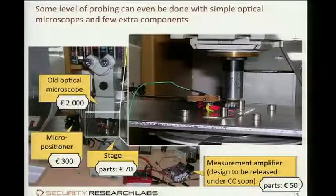Yeah. When you get the needle in position, some folks prefer TTL buffers as buffer circuit. I prefer an operational amplifier in voltage follower mode because it's more transparent electrically. And to know if I'm in the right position, it's just easy. I look at the noise level of the needle, and when the needle is coming in contact with the chip surface and on any wire, hopefully at the right one, the noise level is dropping because the chip is grounded through the EEPROM programmer circuit. That is how I can know for sure that I have contact with the chip and I can start my measurements.